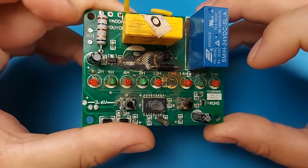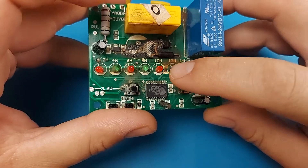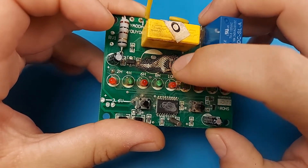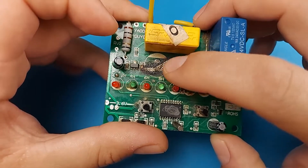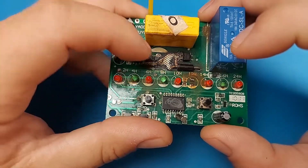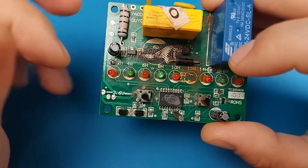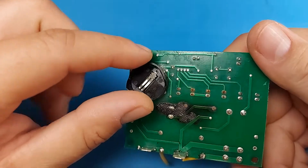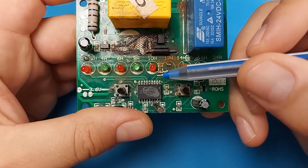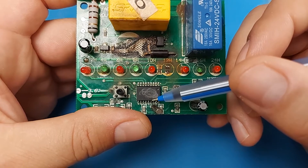Okay, so it is now the next day and I've been poking around this circuit board for a while trying to identify what's wrong with it. I've determined that the microcontroller is burned — it probably managed to jump over some of the voltage that was leaking through the electrolyte of the capacitor, which brought a higher voltage than this was ever supposed to get. I first tried connecting voltage after this regulator and following it, but I wasn't able to see all the tracks because of this battery holder. I've determined that the microcontroller is powered through this ground pin here and this VCC pin here.